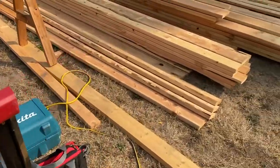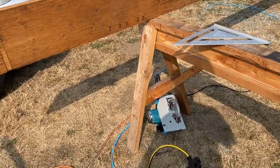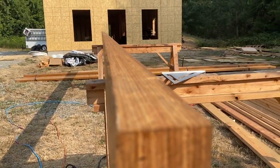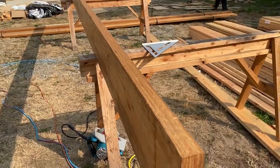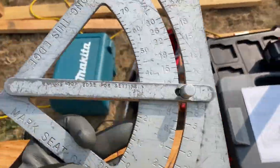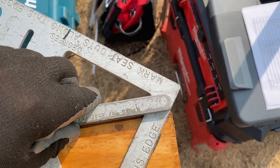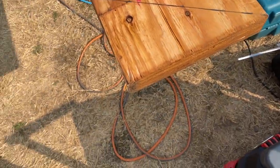I'm just archiving what I know, because I could be dead tomorrow — could have a board fall on me like it did on my saw. Anyway, you see the words right here — you want all the words to be upright; you don't want to install something upside down. But you also have to check: is there a crown? With engineered lumber, most of the time you just put it in with the words the proper way up. The first thing you do — if you look right there — you'll see I'm on the 12 hip valley, and from the long point of the board, go ahead and draw a line.